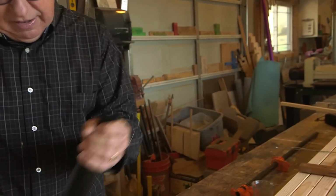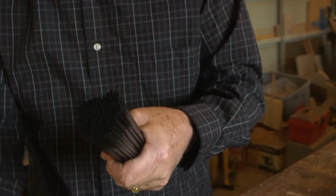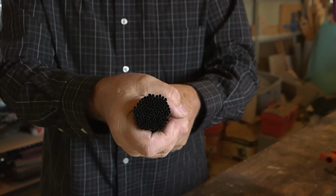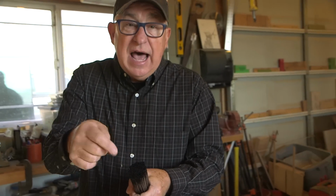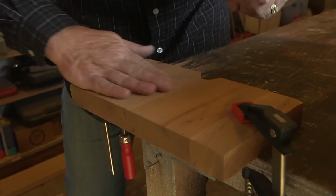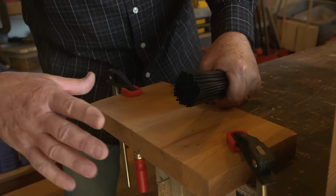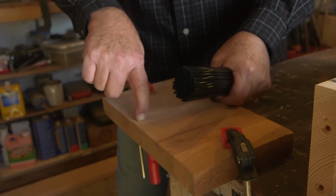Well, I'm going to use a little bit of an object lesson here, or just an illustration. These coffee stirrers are much like the end grain if you magnified the end grain of raw wood. Wood grain is made up of fibers, and you've got these little tubes like this, and as you can imagine, there's a lot of surface area here. So the end grain is going to tend to dry out much quicker than the surface does, and when it does, the wood shrinks, and it's got to give somewhere, so a crack will form just like this. Well, it's good for the wood to be able to relieve the stress, but it's bad for us as furniture owners or project builders when you have this form. So how do you take care of it? Let's show you.